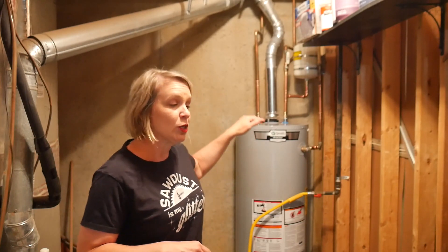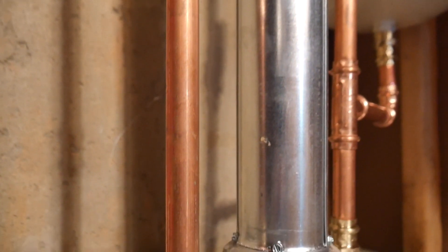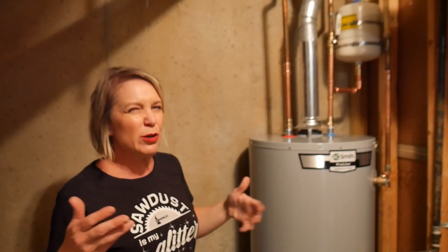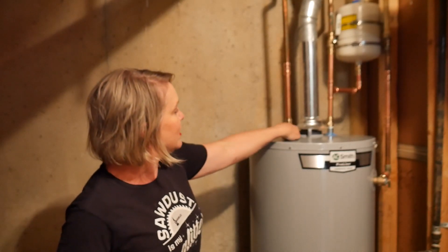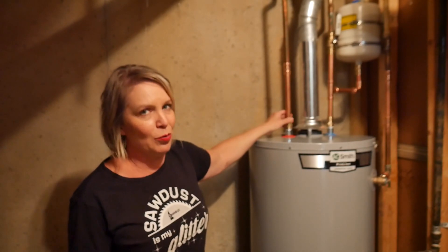Also, because the new tank is a little bit taller, they didn't put it on a rack at the bottom, which means the pipes had to be extended a little bit farther down so the whole thing would fit properly — that would have been really difficult for me to figure out on my own. And if you're going from a 40 or 50-gallon tank to something really big like a 75 or 80-gallon, the connection pieces on top are set wider, so the pipes have to be fitted differently, which means changing the orientation of the copper pipes — a pretty big project.